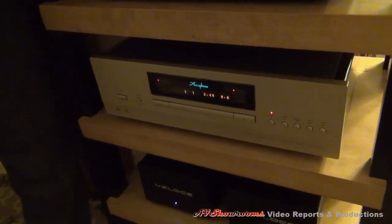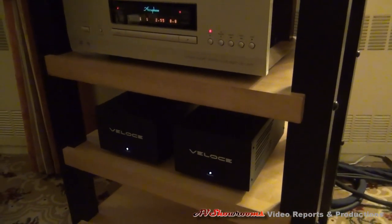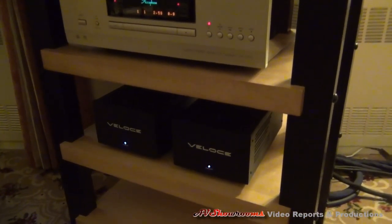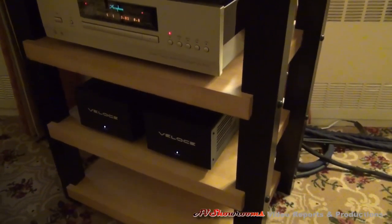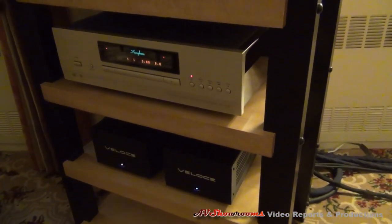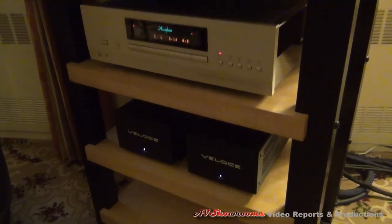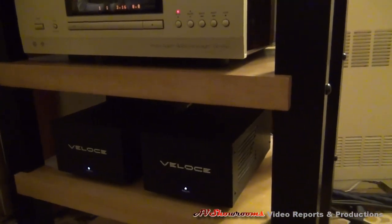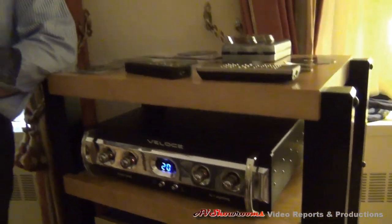Now, these are the power supplies for the unit? They are not technically the power supplies — the batteries are contained inside our main units. These we call smart supplies and basically they're the interface to the wall. They plug into the wall with very inexpensive power cords and no line conditioning required. Essentially we power off the unit, charging occurs automatically. When we turn the unit on, the charger is completely shut off so there's no noise in the system. There's a small analog supply for heating the tube and providing voltage for the volume control.